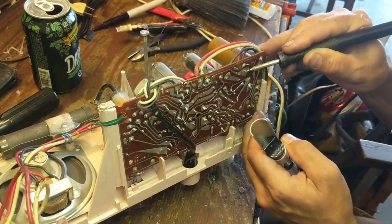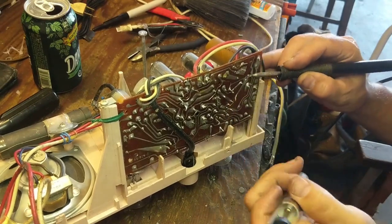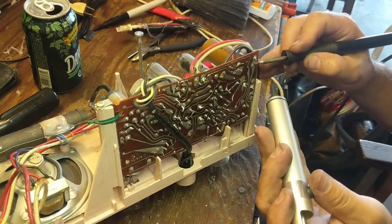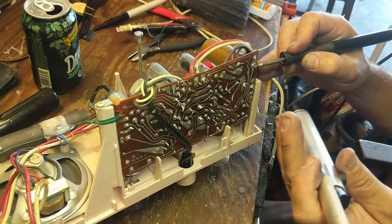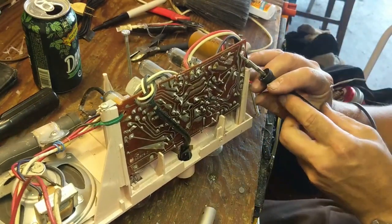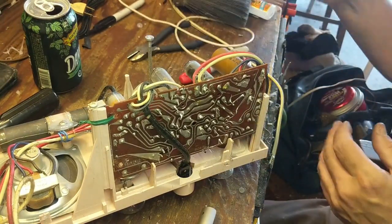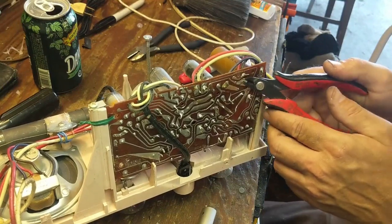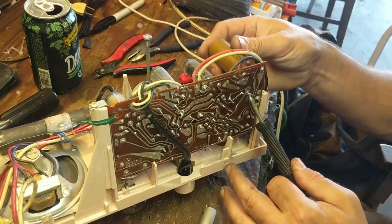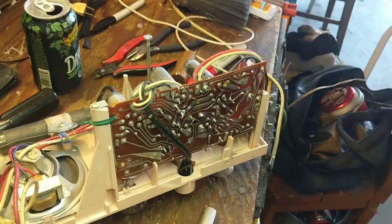These little tabs are bent over, so I'm going to pull the solder out from each one of these guys and do that until I can start prying them up. Here's our last one — this is actually our common negative right here. We'll bend this guy up a little bit, clip each one of these. Make sure you wear goggles or aim away because you'll shoot yourself in the face. Cap is now pulled out — no good. We can put new caps in this place.